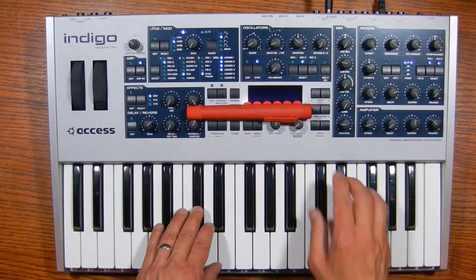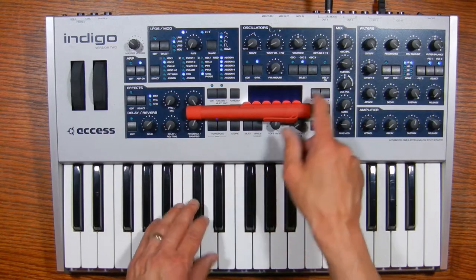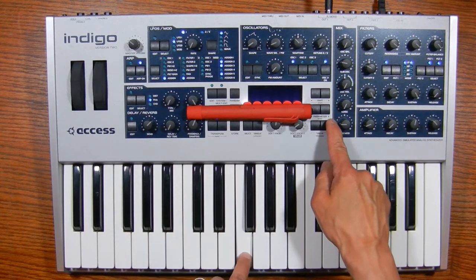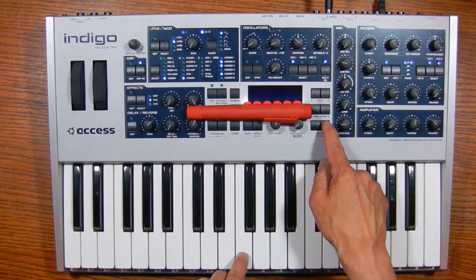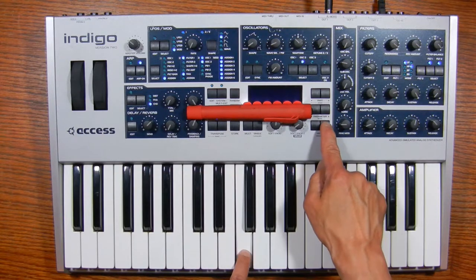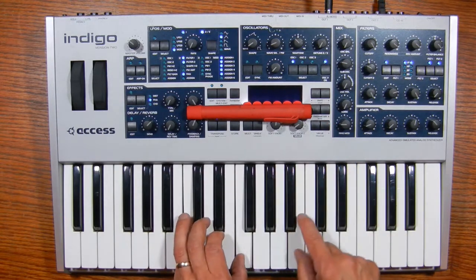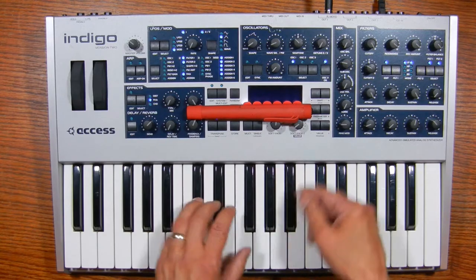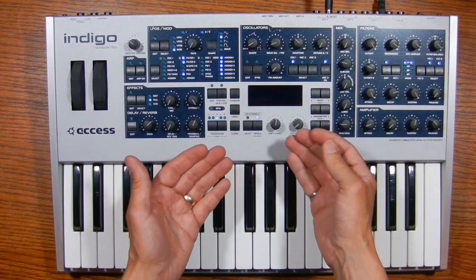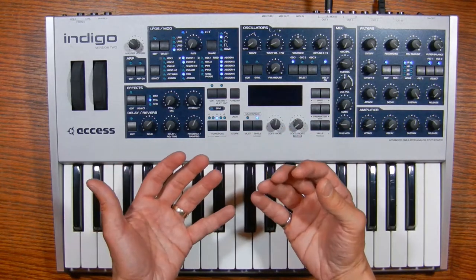The sound is called Sync Star — you probably can't see it in the video, it's very dim. But I can press the program value button and change the settings. So it appears that the LCD module itself is working, but the LEDs that comprise the backlight aren't.